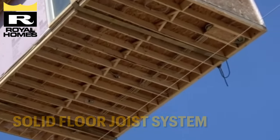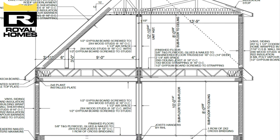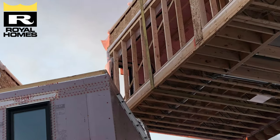When we build a two-story home, the floor trusses are installed on the second floor units so that we can run all our ductwork and plumbing for the upper units in the floor cavity. The mechanicals are then run to common areas using a mechanical chase.